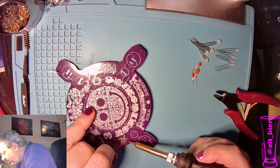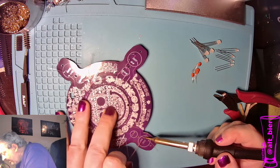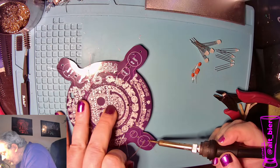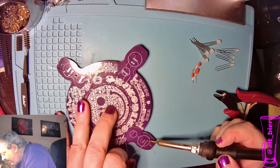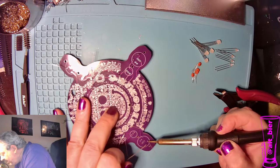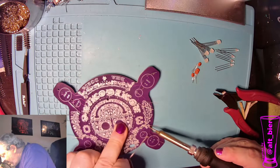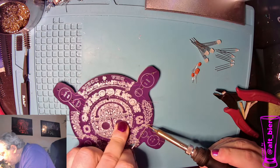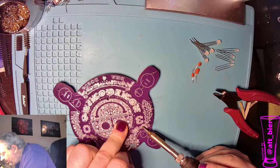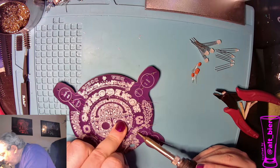Like I said, these go fairly quick. The resistors have really thin legs, and the thinness means they heat up really quick. When you're soldering, you want to hit both the pad and the leg, so having thin legs that heat up quick makes it go really quick. When you're doing those thick header pins on the Pi, you'll see it goes a bit slower because it takes a while for those pins to heat up compared to these pins. It's not a huge difference, but it's noticeable.